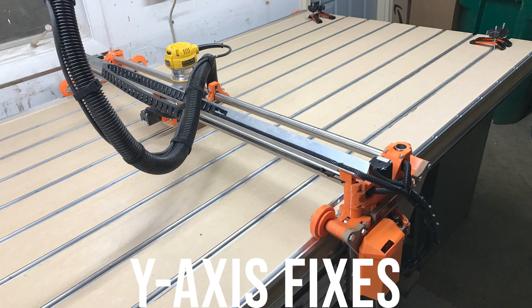At this point I had also added some aluminum channels for hold-down clamps. Unfortunately after doing all that work I realized that the base plate of the machine is so large and low that it really interferes with using any large clamps. Almost every time I use it I just had to screw my workpiece directly into the table, otherwise the clamps would just interfere.